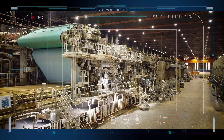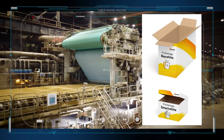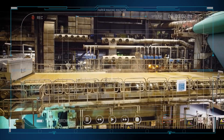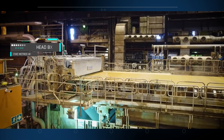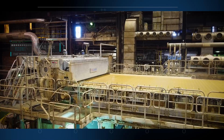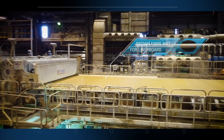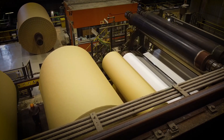It is now time to use the pulp to make the paper that will be used to make paper packaging, with one side being white to enable printing and the other side brown. This pulp is sprayed onto the wire belt of a paper making machine. The spray nozzles are located in the head box and water is drawn off at the bottom of the machine. All water is captured and reused in the different factory processes. The fiber mat that forms on the wire will become liner board that is used to produce cardboard boxes for the fruit industry.